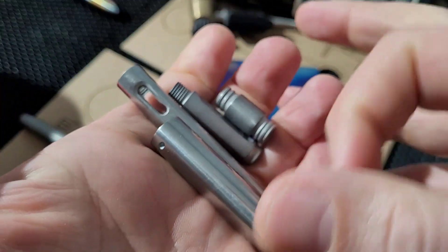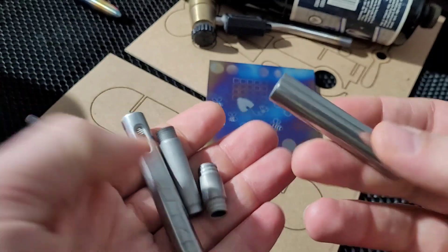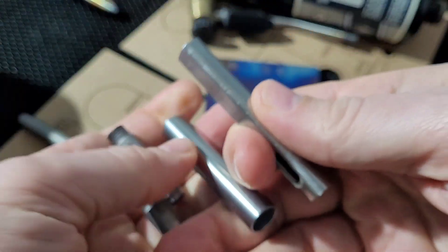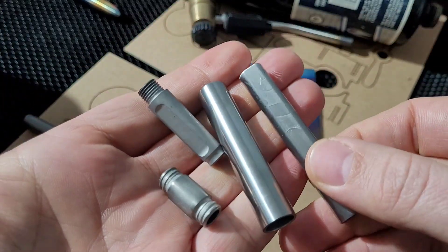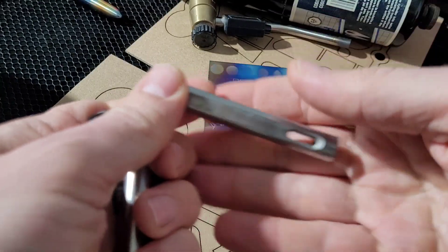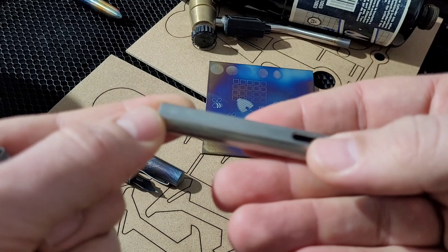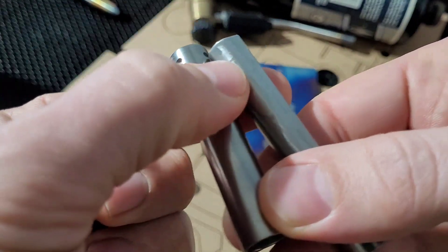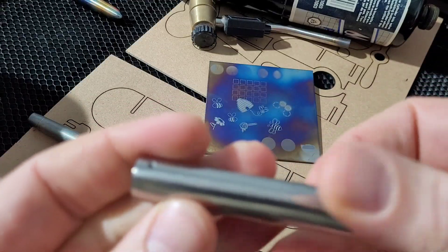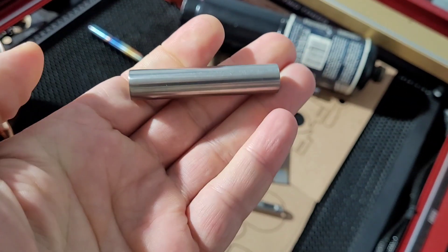I have a pen here — I'm probably going to order some titanium tubing as well. I haven't done the review on this yet because it's just a terrible pen. This is a titanium Safari knockoff — a Lamy Safari knockoff. I did a splash anodize because the build quality is just bad. I'm at least going to try to make it cool. I made a fatal flaw and screwed it up, so I was going to restart and sand it, but it's hard to get that off — you can still see the waviness. This one's easier to do because it's fully round, so I can throw it in the chuck. This will be a perfect test specimen for the cool titanium anodizing I want to do.